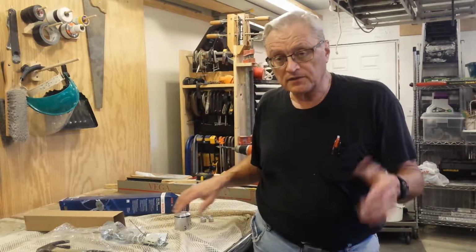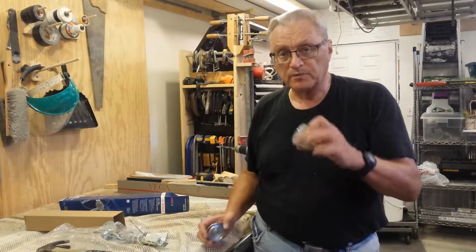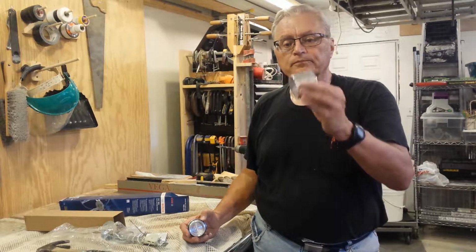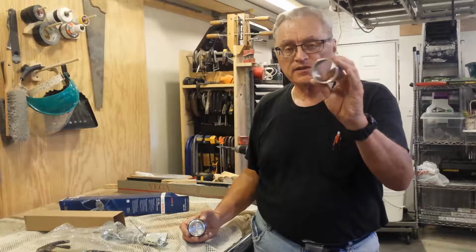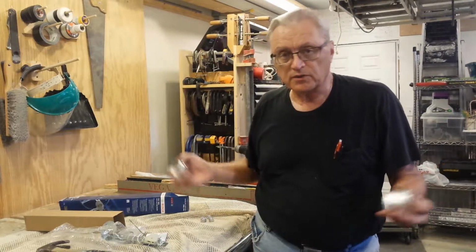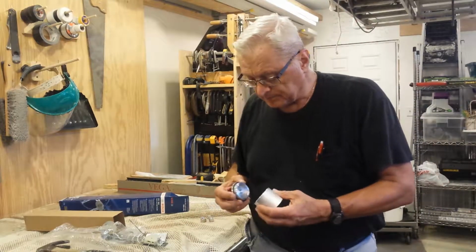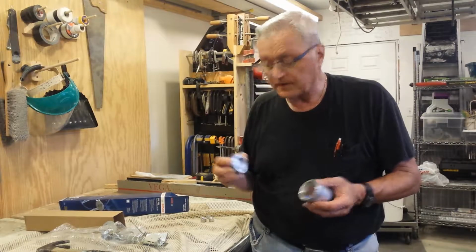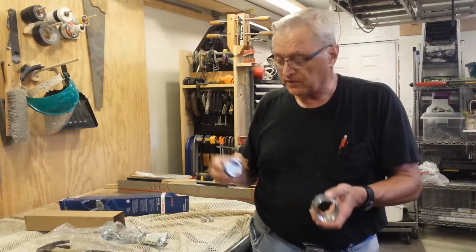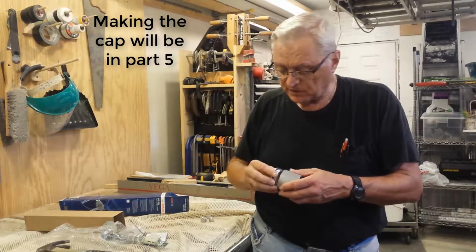So what I decided to do was order some 2-inch aluminum pipe. I think I got that from Speedy Metals. 2-inch ID, I think it's Schedule 40. I ordered some bar stock. I have access to a lathe and to a mill, so why not just roll my own? That's a lot of what we'll cover in the video today: machining the threads, machining this cap. You get to see some of my bozo moments.